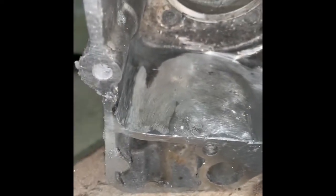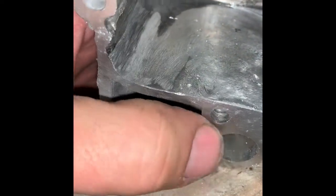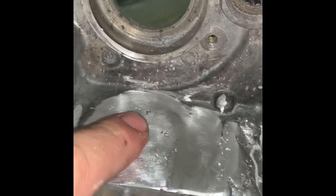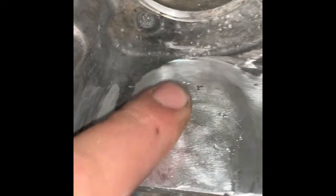I've gone ahead and cleaned up the weld. What I did is I took my rubber air nozzle, plugged one side of the screw hole with my finger and the other side with the rubber tip of the nozzle, and found there was air still leaking out. So I got some soapy water and did a bubble test. I found I still had some pinholes or wormholes in this weld, or I didn't weld far enough toward this side of the crankcase to weld the entire crack shut — one of those two things happened.